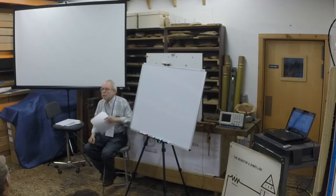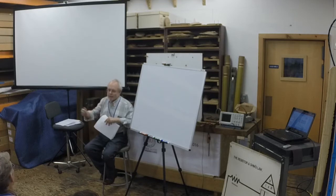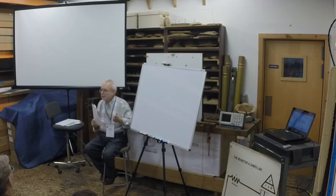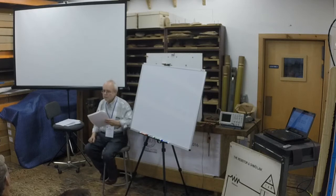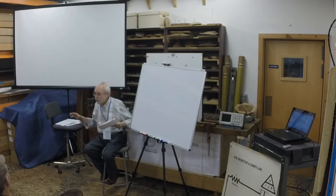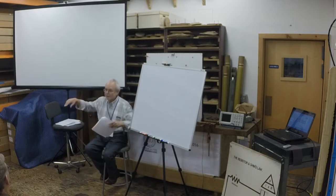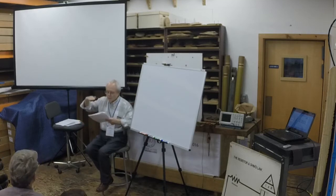And then you simply have the electrician. Not that anything is simple when dealing with electricians. Run outlets around the organ, and so you can plug your power supplies in, and when you turn on the organ, they all come to life. That has advantages that we'll talk about later in terms of voltage loss in the wire. But in the case of an instrument where the organ and the console and everything is connected together, you will typically have one common negative terminal that runs through from power supply to power supply. So every voltage is referenced from the 0 going up.